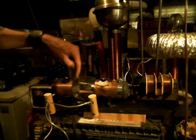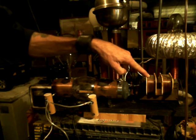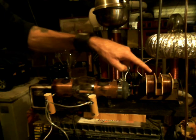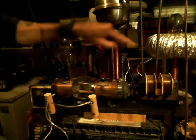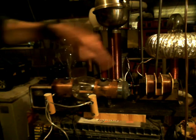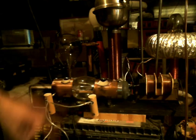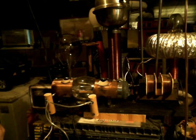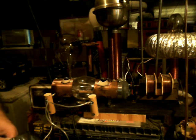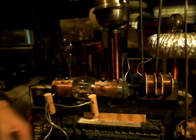The energy goes back out the other end, down into the primary coil of my transformer right here. Then from there it goes back into the bulb and keeps making a loop into the plasma chamber, building up energy the longer you leave it running. I have a primary coil, a secondary coil, and my plasma chamber, all being run by a 20,000-volt oil burner igniter. I'm going to get back over here on the other side and do some adjustments, then show you this.